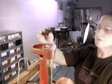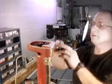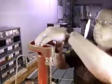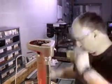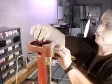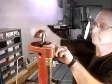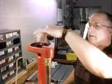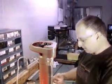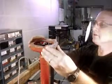At this point we're going to put our new impeller on. That's seated on the split pin in there. Put my key back in. And the hardware. Snug that up like so. And it spins freely. Take my two new gaskets. Put those in place.